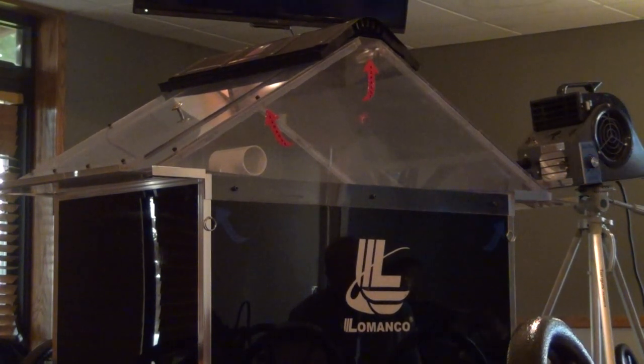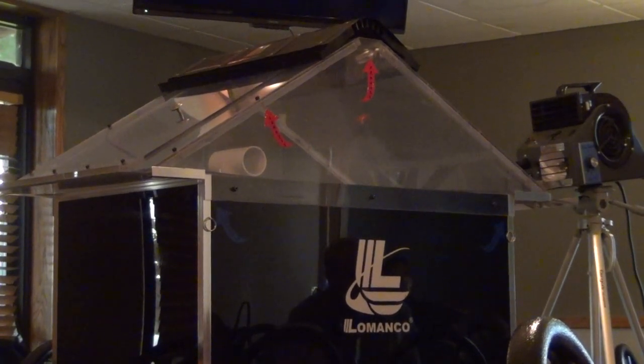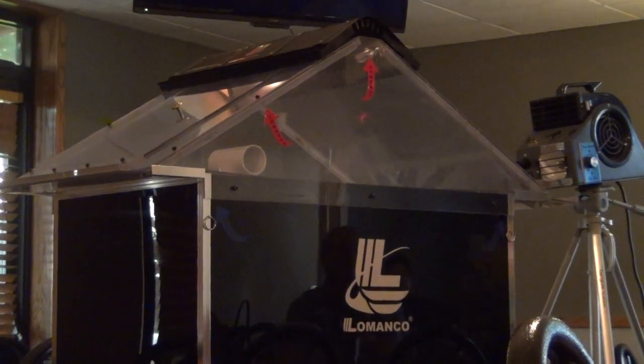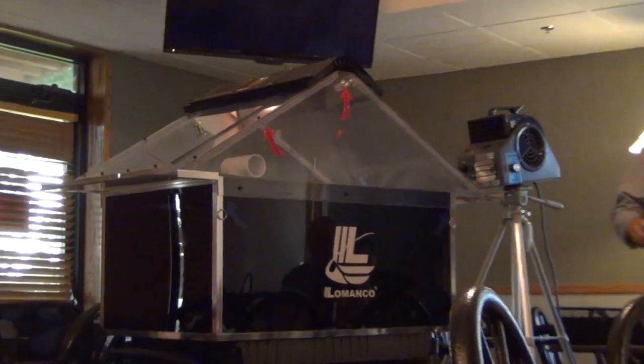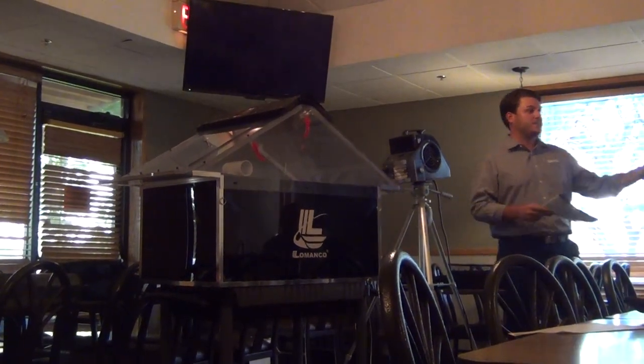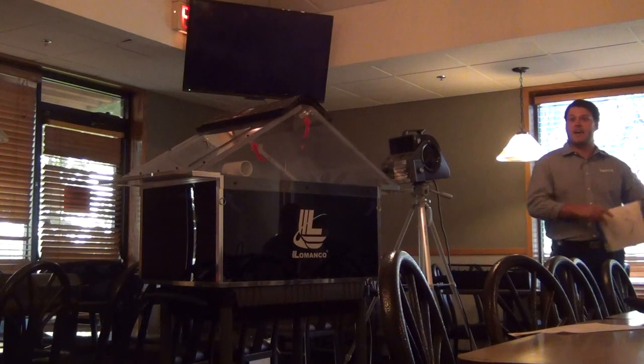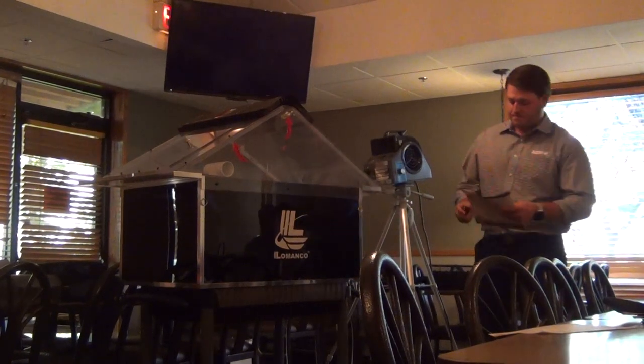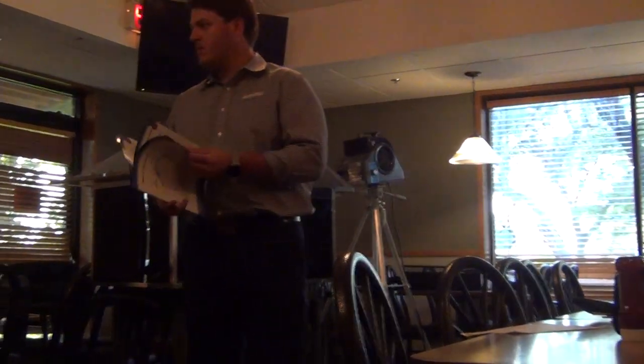Back to the issue of putting ridge vent on each ridge — if you throw it on dormers, if you see ridge vent on a dormer, it's okay to keep it, but block that dormer off and make your own little attic space. Make sure there's a little soffit and something there to create air movement. A lot of people don't do that, and it really creates an issue — not just with dormers but with garages. With garages you literally want to create a separate attic space if it's not connected. So if you have multiple ridges and multiple elevations, you don't want ridge vent anymore.